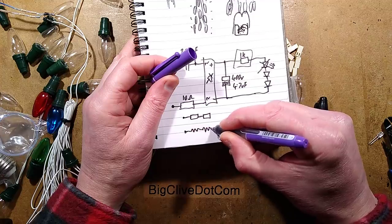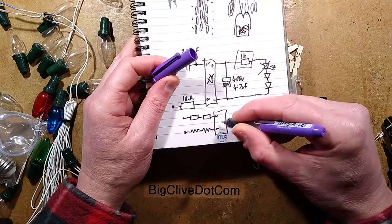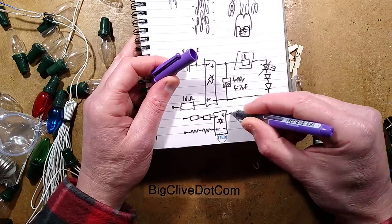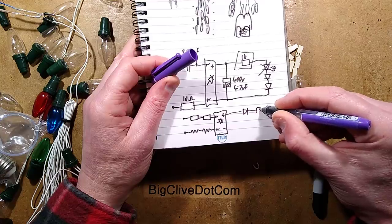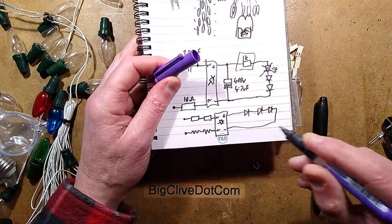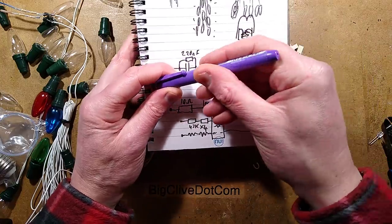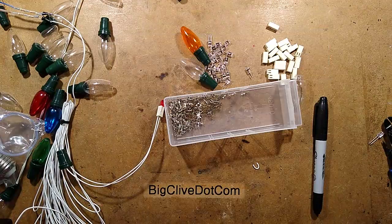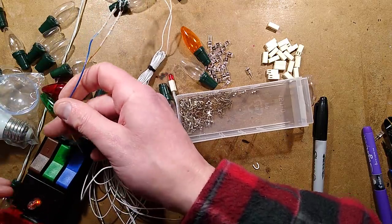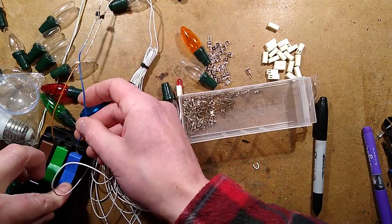Let me just doodle that for you. Instead of the full circuitry, what I've got at the moment are a couple of resistors. The value I used was about 47K for each, just designed to limit the current enough so I don't get a bad zap - I could get a tingle off it but it's not going to be the end of the party. Into the quick test it goes - I also put two on either side just for extra electrical separation.